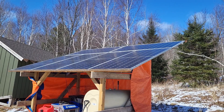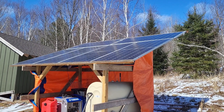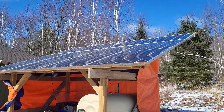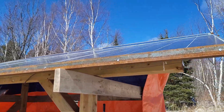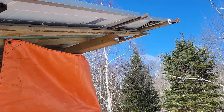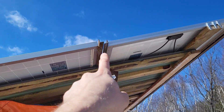What do you guys think? That's an extra little over 2,000 watts — I haven't actually added it up yet, it's like 2,300 or 2,200 watts or something. Just use angle iron, mount it to the panels — both sides and the middle. Because they've got two pieces of angle iron, I went inch and a quarter in the middle and two inches on each side.